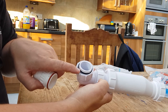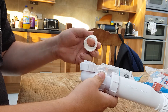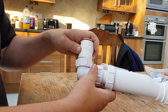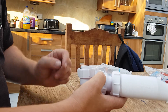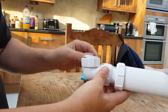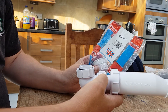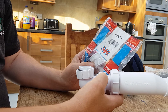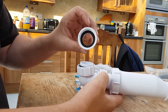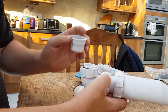This fitting does not seal onto here. If you look, there's about a 4mm space there and it really has to push down and seal upon that rubber washer — and it doesn't. There may have been times where installers assumed that screwing it up would pull it down, but no matter how much you try it just will not seal. I know McAlpine don't do a flat-flange elbow, but McAlpine do make this fitting here, which is called a waste extender — product code S12A-F.